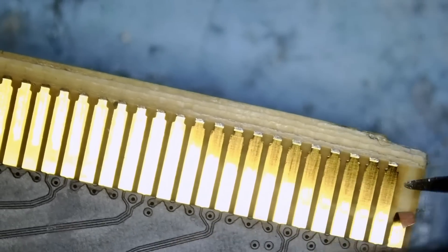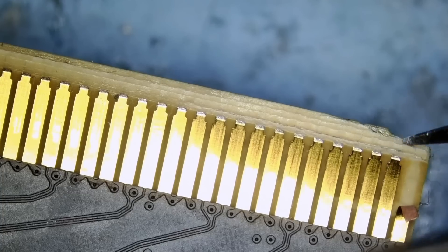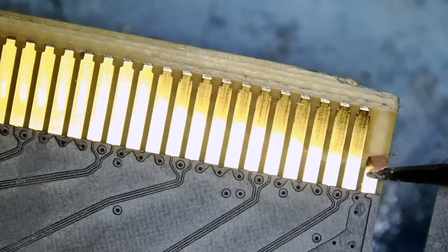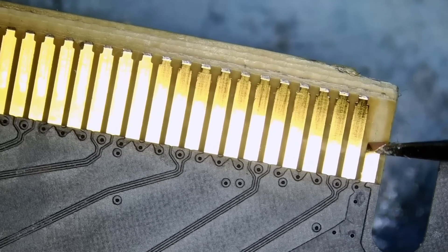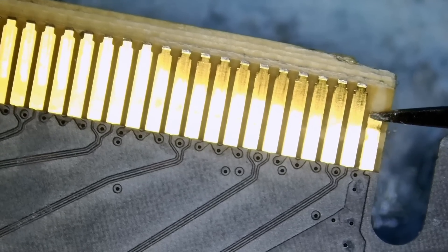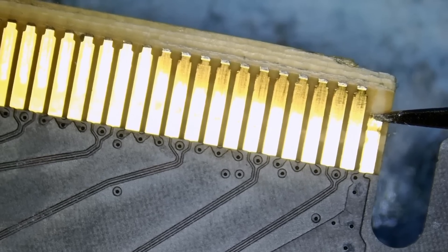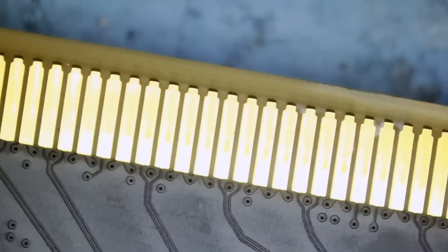If you look here we have a board that's separated. We may be able to just put some glue in between and press it. And for this one here maybe I can put a drop of glue here, or even put solder mask on the very tip of that pad to hold it down in place. I think that's all what we need. Rest of the pins are good.